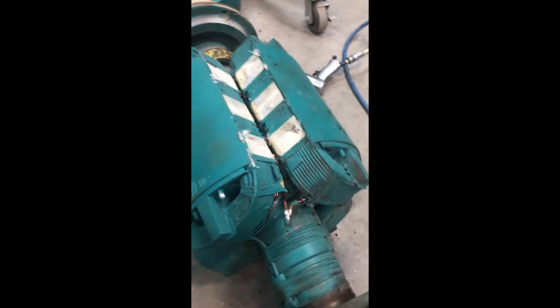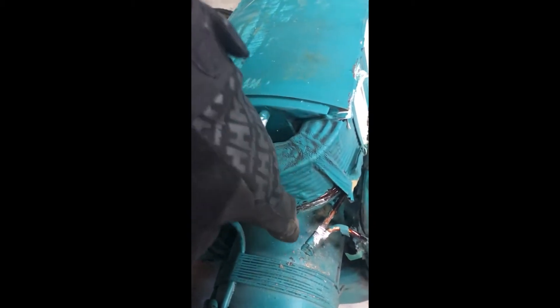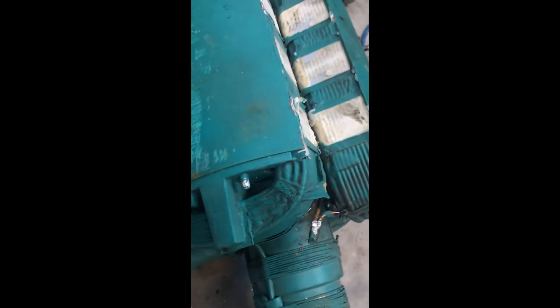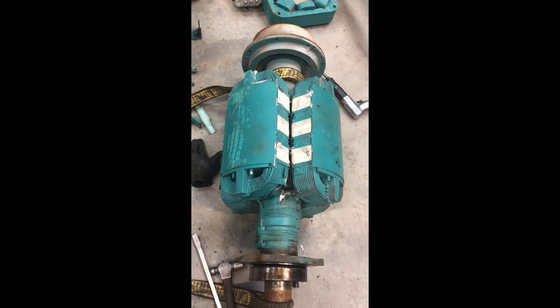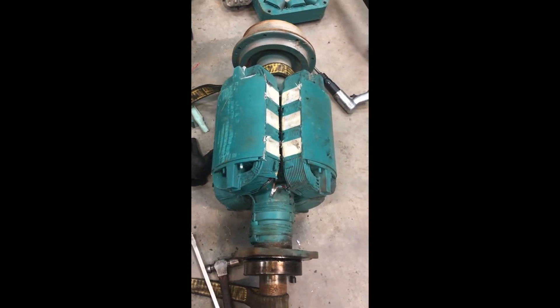and I'm not really caring about salvaging the armature, I think what I'm going to go ahead and do is cut the windings right across and see if I can open them up and peel everything away. Now these armatures, same as starters, same as alternators, they're laminated. There's multiple little pieces put together, so it makes it a little bit easier to maneuver those pieces if you've got an air hammer. Hopefully that will be an advantage on this one and I won't have to fight too much to get the coil out, so I'm going to try the first one and see how it goes.